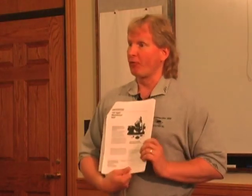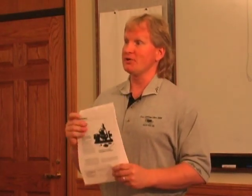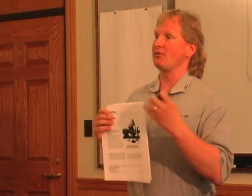Other than that, it still has the Chesterton 442 split seals on it. The only difference is going to be, now we're getting into the smaller seals, which become a lot more complex. Again, it's the exact same seals as the bigger pumps. The difference is now, again, when I was making comments about technical ability, it's a very low scale, not too complex. However, it's cumbersome for larger hands.